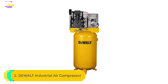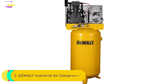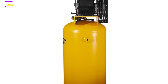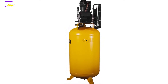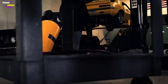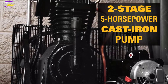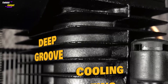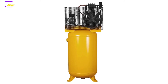Number 2: DeWalt Industrial Air Compressor. This beastly DeWalt 80-gallon air compressor is built for tough job sites, well-constructed for great performance for professionals, as well as efficient in durability. This DeWalt 80-gallon air compressor is equipped with an industrial-class TOPS motor. The 5 HP heavy-duty motor is single-phase and operates on 230 volts. The motor is protected from voltage variations with a thermal overload protection system. Another great feature is that it does not need a magnetic startup. Some tasks need multiple air tools simultaneously, and with the DeWalt compressor you won't require extra units to run them separately. The mighty two-stage pump delivers enough air to drive more than one tool at once, so you can finish your job in less time.